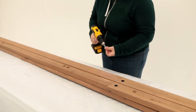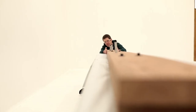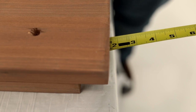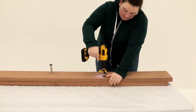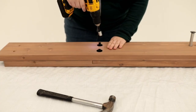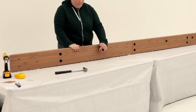The shorter bolts are attached to the T-nuts that sit in the groove on each end. Have someone help align the boards, then make sure the outside beam assembly B overhangs each end by 1 9/16 inches. If the measurement is not correct, loosen the bolts on the outside beam B assembly and adjust the boards. Once you have the correct measurement, tighten all bolts and remove the pins.